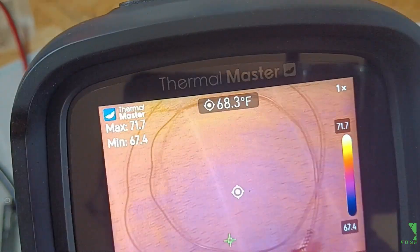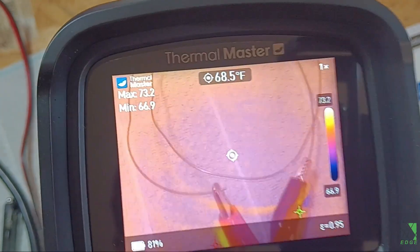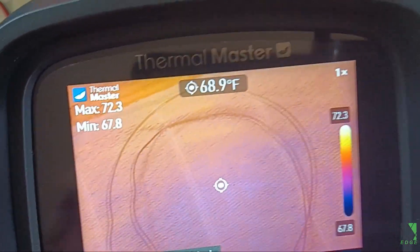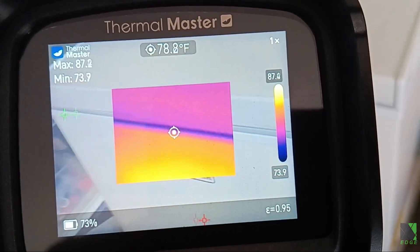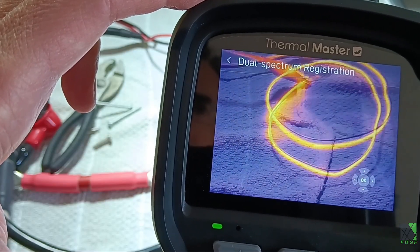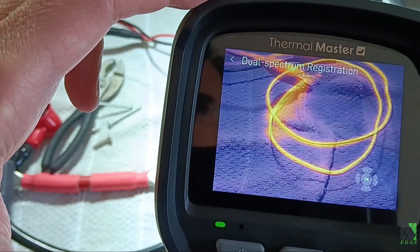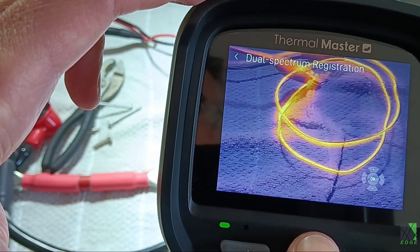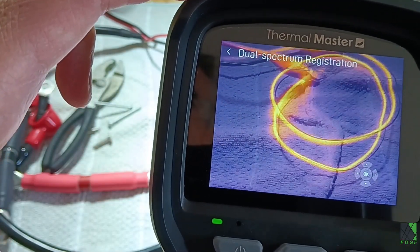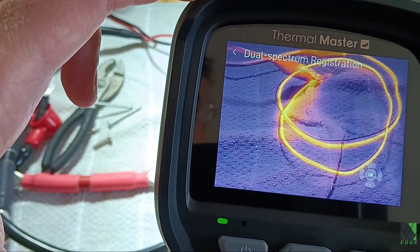In this test I'm warming up a piece of nichrome wire and fusing the visible camera with the infrared camera to get a better view. Due to parallax — two cameras on different axes — it's sometimes a little hard to get the two to line up. There is a utility built into the camera that allows you to align the thermal and visible light cameras. Here you can see I'm using that utility to line up the nichrome wire in the visible spectrum with the infrared spectrum. Once aligned and parallax is mostly eliminated, it's a lot easier to get oriented and figure out what you're looking at.